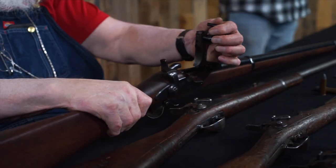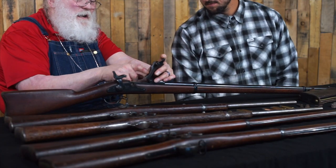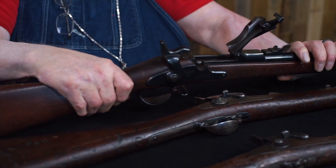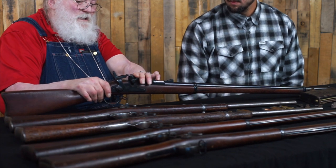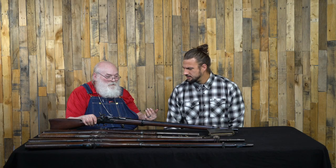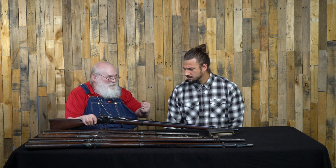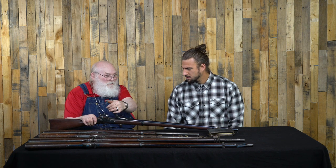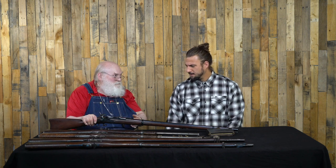This is what they call a high arch on the action — you can see it's scalloped out quite high on the inside. That weakened it a little bit, so they went with a low arch later on, which gave more strength to the breech block. They also changed firing pin materials. They found that if you had oil and let it sit with the hammer down, the firing pin could freeze — lock into place protruding. So if you dropped a shell in with a protruding firing pin and hit it hard, you could make it go off.